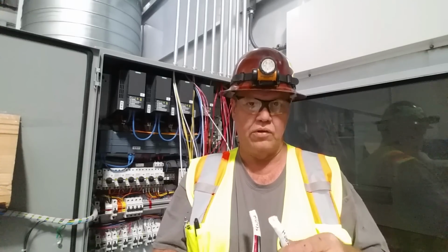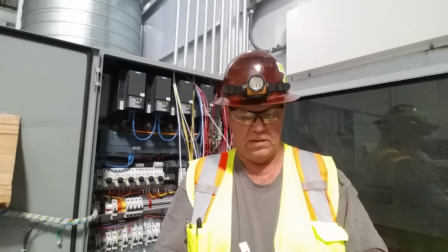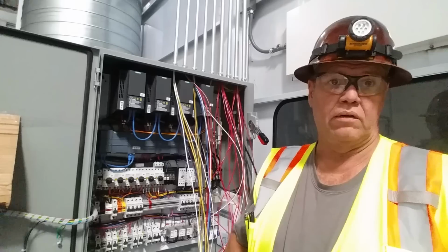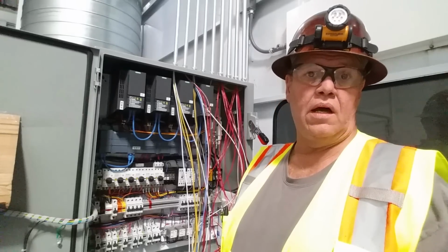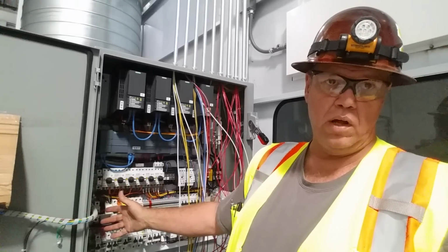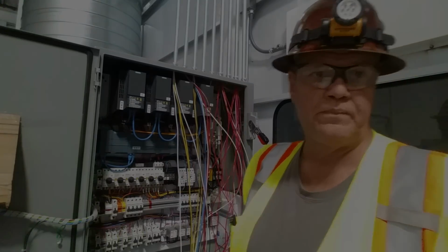Quite often it's just easier to pull in, what do we got here, 2, 4, 6, 7, we got 7 wires, so it's not a big deal to ring them out. I've run circuits up to 100 before, so it's not a big deal. It just takes a little time. All right, so let's get this loomed over where it belongs. Get it in at least in the same zip code, and then we'll work on ringing them out and getting them landed.